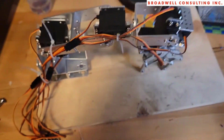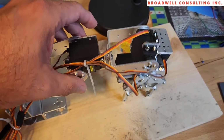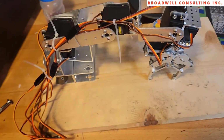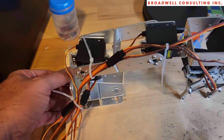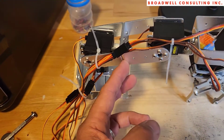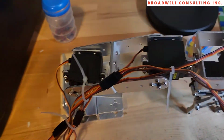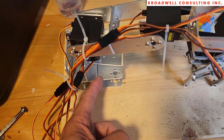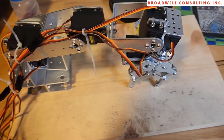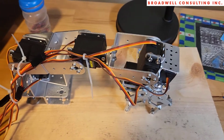So, the arm is essentially a toy. This is not a serious robot arm. There's an enormous amount of play in everything. All of the parts are made out of aluminum, which surprised me, even though it said it somewhere in the description. I thought they'd be steel. I really wish they were, because I think putting a little tack weld on each of these things might help a little bit with some of that play. I can't weld aluminum, I can only weld steel. Putting a little flux tack weld on each of these things might help with that play, and certainly make the thing last longer without the maintenance of screwing everything together.